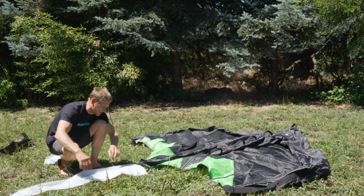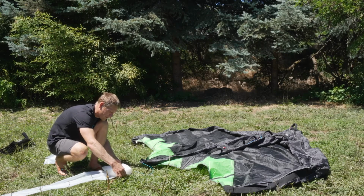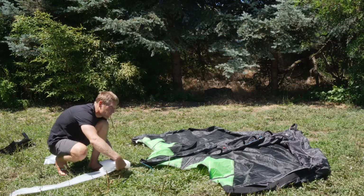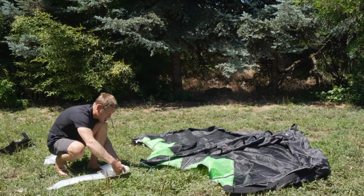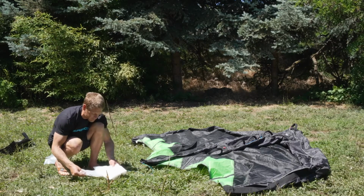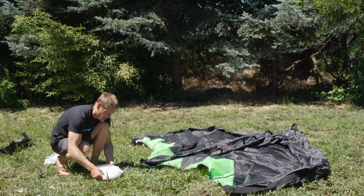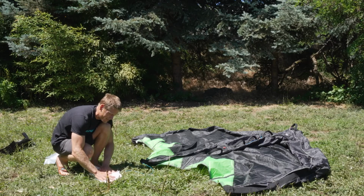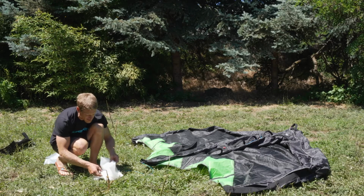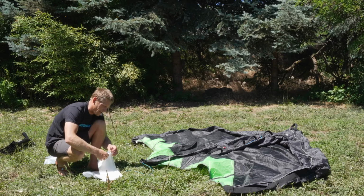This is not something that's super painful on a strut, because a strut is a small bladder replacement, but when you start to have to do a leading edge or something with a longer strut, it does become really important that you manage the bladder going back into the tube in order to reduce your chances of having a twist. So you can see I just folded it over itself, over itself, over itself until I end up with a small little package. I have my valve here.